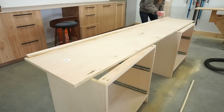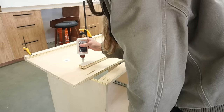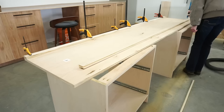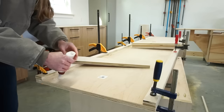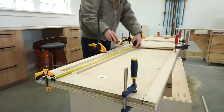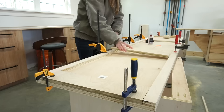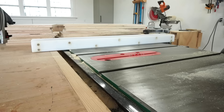I used another one of those leftover plywood strips for the desk top and ripped it to 20 inches wide, but left it a full 8 foot long. I wanted my countertop to be thicker than just one layer of three-quarter inch plywood, but didn't want to bother gluing up a panel of solid wood or waste a bunch of plywood making a full double layer. So instead I glued some scrap pieces along the edges and a couple in the middle where the insides of the cabinets would rest. While the glue dried, I started working on the drawer boxes.